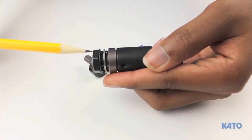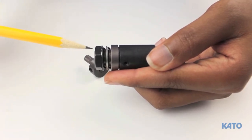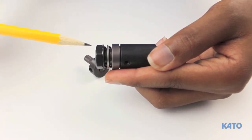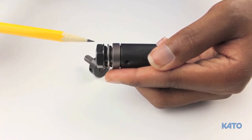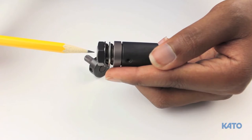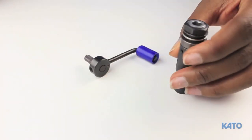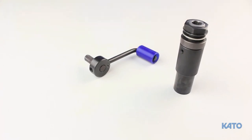At the top of the clutch drive, you'll find a lock nut, two wavy springs, and two washers. The lock nut is the part that you're going to turn to increase or decrease the torque. Turning the lock nut clockwise will increase the torque. Turning the lock nut counterclockwise will decrease the torque. This handle is included to manually adjust the torque during initial setup.